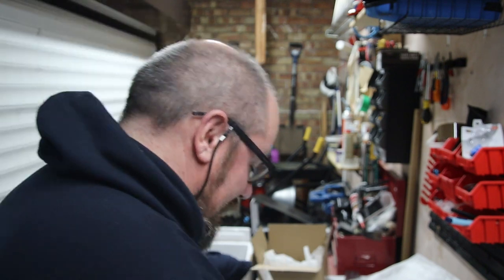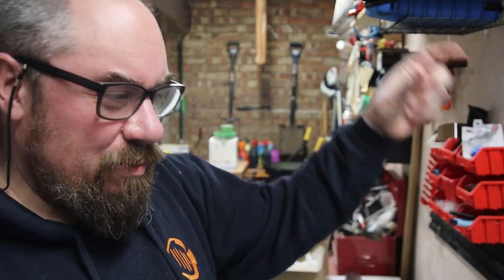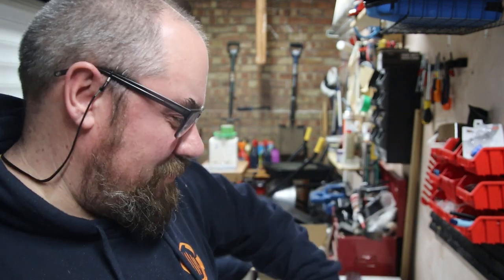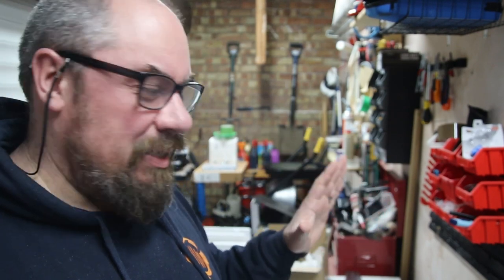So I don't think bracing is the problem. My problem appears to be that the silicone did not bond with the liquid rubber, and that's what we're going to try and address. I'm going to take the chopped strand mat, cut it into strips, run that along the bottom and the two sides where the glass meets, soak it in the fibreglass epoxy resin, and let it harden off. That should give us a good solid seal.